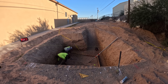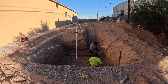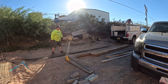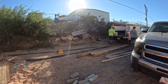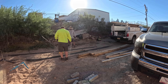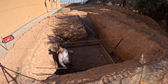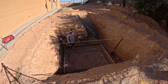We're going to pour the bottom slab first with all of our rebar tied in and all the verticals around the perimeter, then we're going to start forming up off of that slab. We're going to do six-inch walls. I went down to Lowe's and picked up some five-eighths — might even be half-inch plywood. I would prefer three-quarter inch to do these walls, but for the price difference I made it work with half-inch plywood.